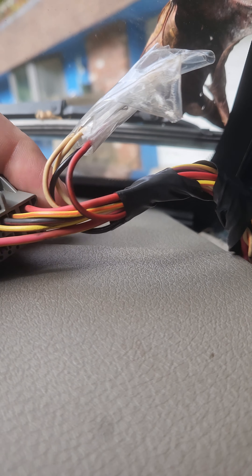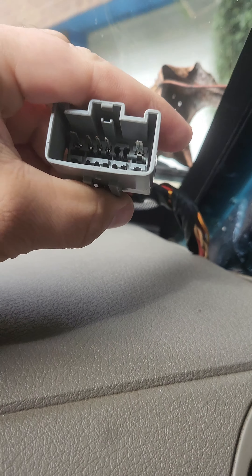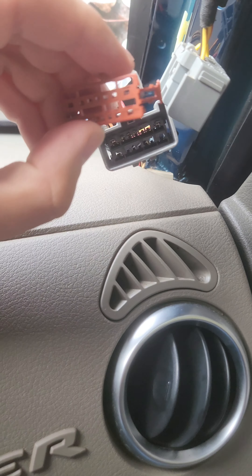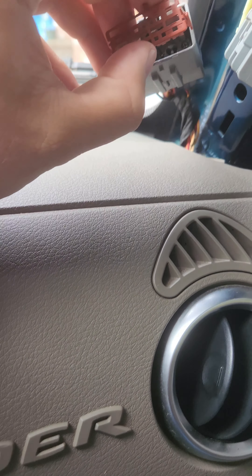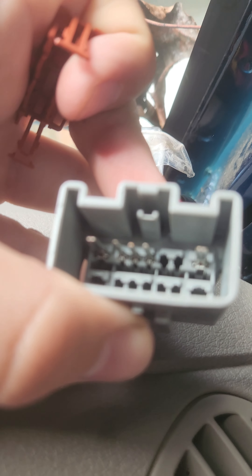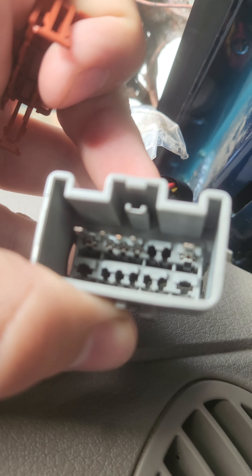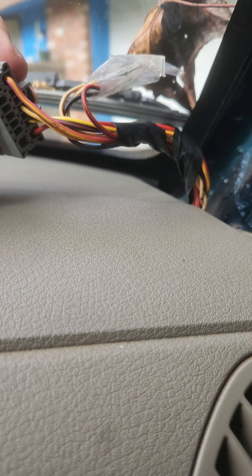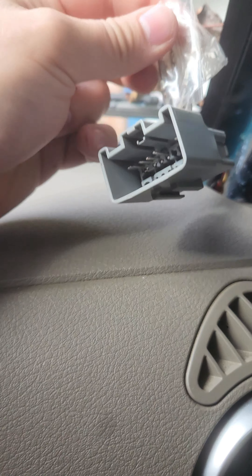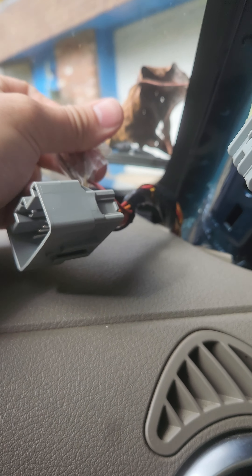There were four more wires in it, and what I did was — there's a little brown piece like this that sits in here. If you take this out, and then on the bottom of the pins, you could push upwards and then pull the wires out the back. So I did that. And then I'm going to put connections on these and wire them up.